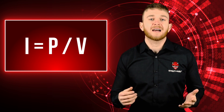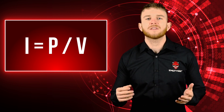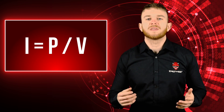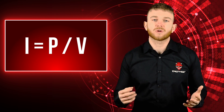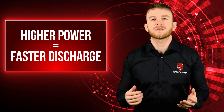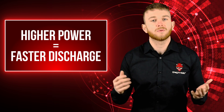The next formula is I = P ÷ V. To calculate the current drawn from the battery if using a regulated mod such as an ARC5, divide the power by the voltage. The higher the current drawn, the faster the battery will discharge; the lower the current drawn, the longer the battery life will be. Now, if you're using a kit that allows you to adjust the wattage or voltage, the higher you set it the faster your battery will discharge. If using a direct current, bypass kit, or mechanical mod, atomizer head resistance will play a big part in battery life — the lower the atomizer head's resistance, the more power is generated at the coil, drawing more current from the battery, which means less battery life.